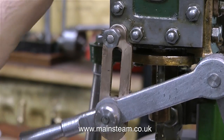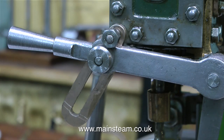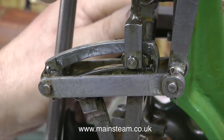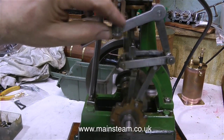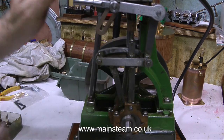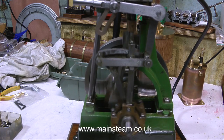It's a simple fix — I just machined off the boss and then refitted the bracket. I even re-profiled the rear of the clamp that clamps the reversing lever to the bracket, and this allows it to go all the way to the top. Not unsurprisingly, it now runs in reverse — well, sort of. It's a bit lumpy. In fact, it's incredibly lumpy.